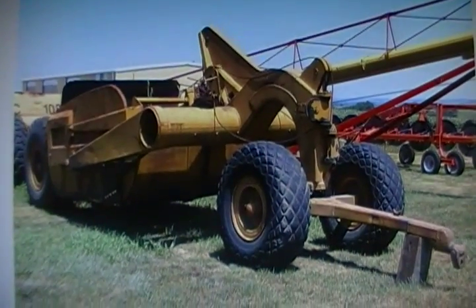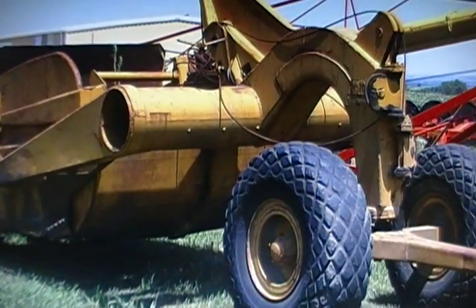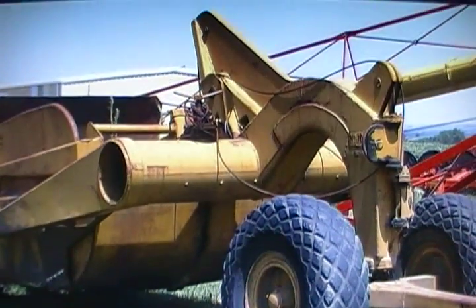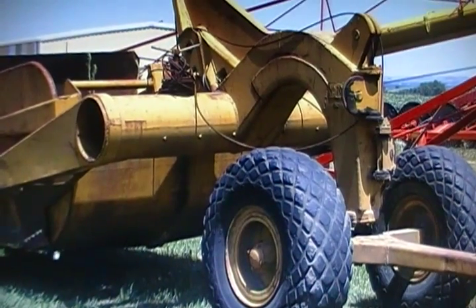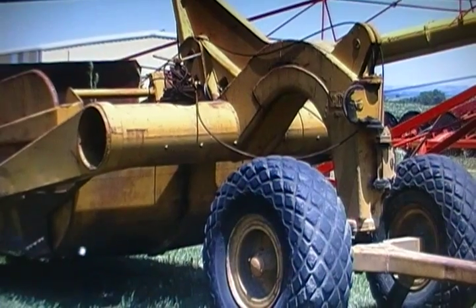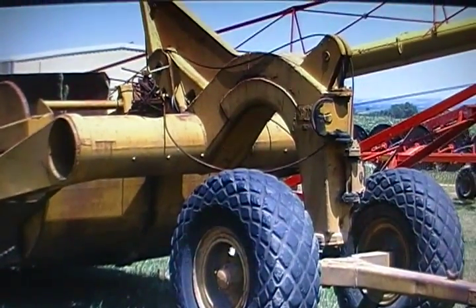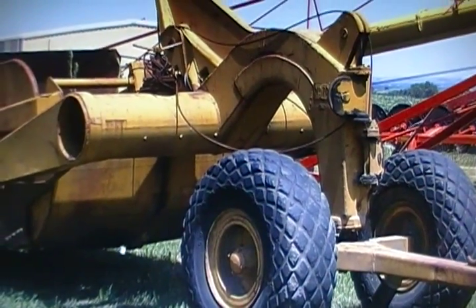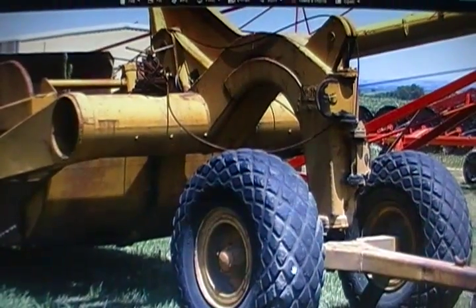This is a CAT70 round bottom. You can tell it's a round bottom by the rear spindles instead of the sides around the tires. Round bottoms are a little harder to finish with, but they pull easier — they've got kind of a bell-mouthed bottom. They're pretty flat and they cut nice, but where that center's a little lower, they'll dig in. It's kind of like adding cutting teeth to a bucket.